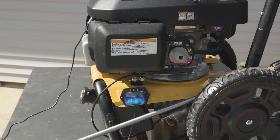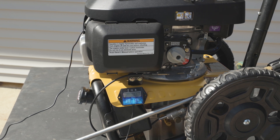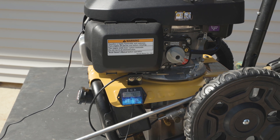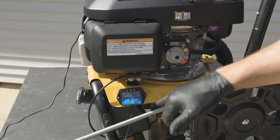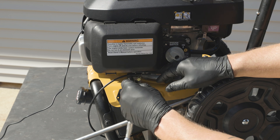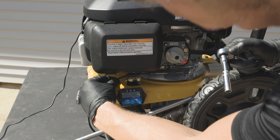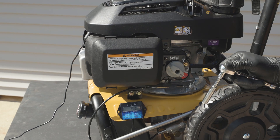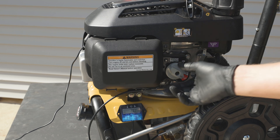As you can see, while we were running our unit it was sitting at about 3200 RPMs, a little bit above that, which is too high for the idle point on this unit. So what we're going to want to do is take a 10 millimeter wrench, socket, and screwdriver and pop these loose just enough so that we can have access to the cable and freely move it around as needed. Then we're going to start the motor back up and adjust it into that 2600 to 2800 RPM range.